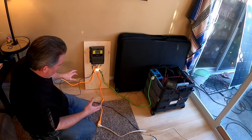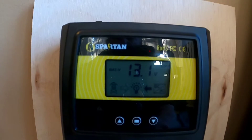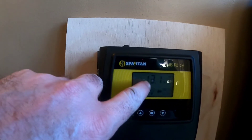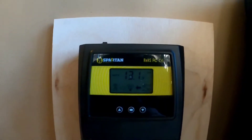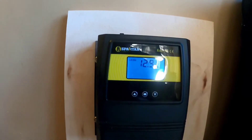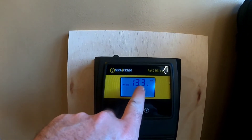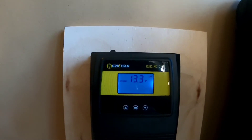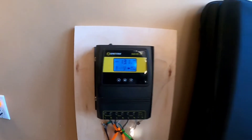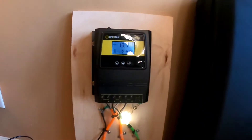This is an AC transfer switch. Right now I'm running off battery power. There are wires that connect to the battery to monitor its voltage. When the voltage drops below 12.9 volts — because I'm using lithium iron phosphate batteries — it automatically switches to grid power. And when the batteries fill back up to 13.3 volts, it'll automatically switch back to pulling off the solar and battery combination instead of off the wall. I've got plenty of capacity and can run the TV for hours and hours.